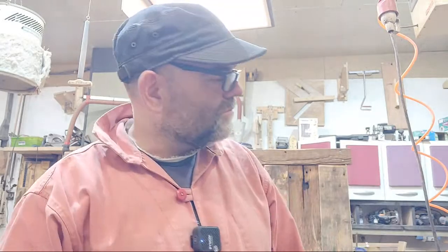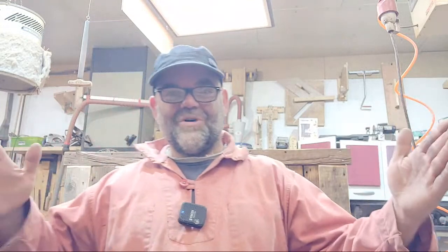Do I have a burnisher? I don't actually have a burnisher. You're talking about like a big mop. I've got my linisher, which is like a big belt sander, a giant belt sander. It's quite a big one, and I use that a lot for my sharpening. I've got it set up for the primary grinds for my planes and my chisels. Because it's flat, it does such a good job. You don't end up with any concave like you would with a Tormek or anything with a round grinding wheel. So it does work really, really well.